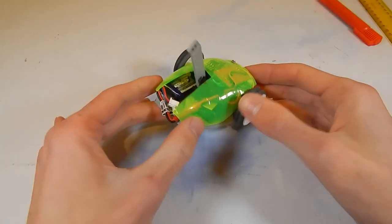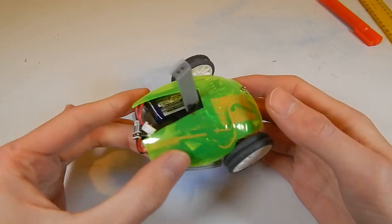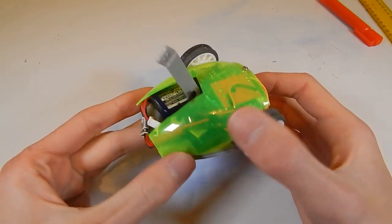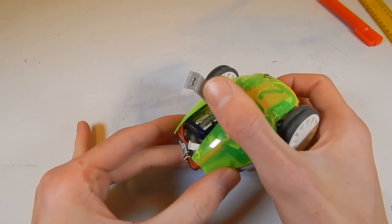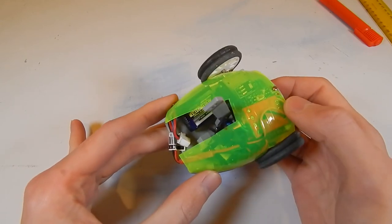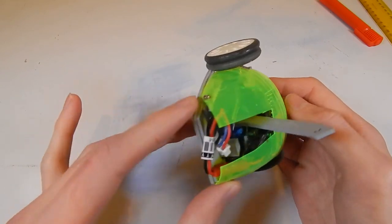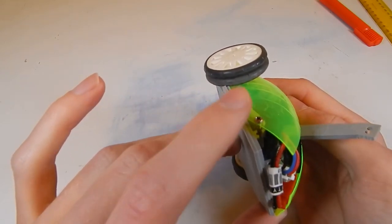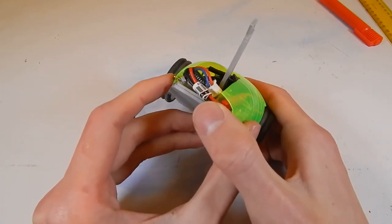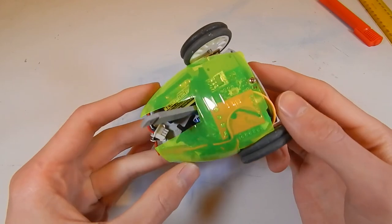So there we go, that is the very first episode of Will It Bot, and in this case I think it will. We did have that weapon failure here, but on the whole, it still kind of looks like a bottle. It does have a weapon. That weapon failure was because I only finger tightened that nut, and I probably should have had two up there. To do this again, with some changes and upgrades, I'd reprint the shell and thicken up the holes that I use to bolt down the outer shell, and I would work out a better way of having my power cable, because that is my power cable right there right now, and that is sketchy as anything.